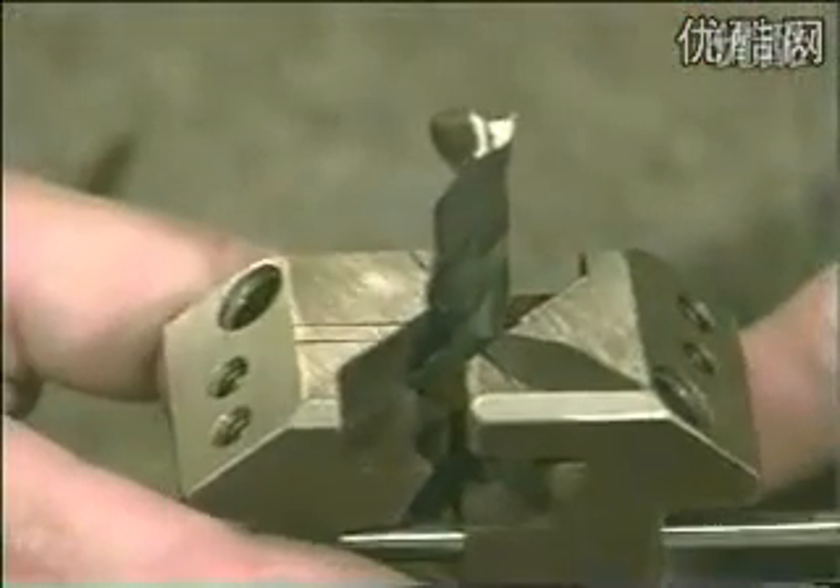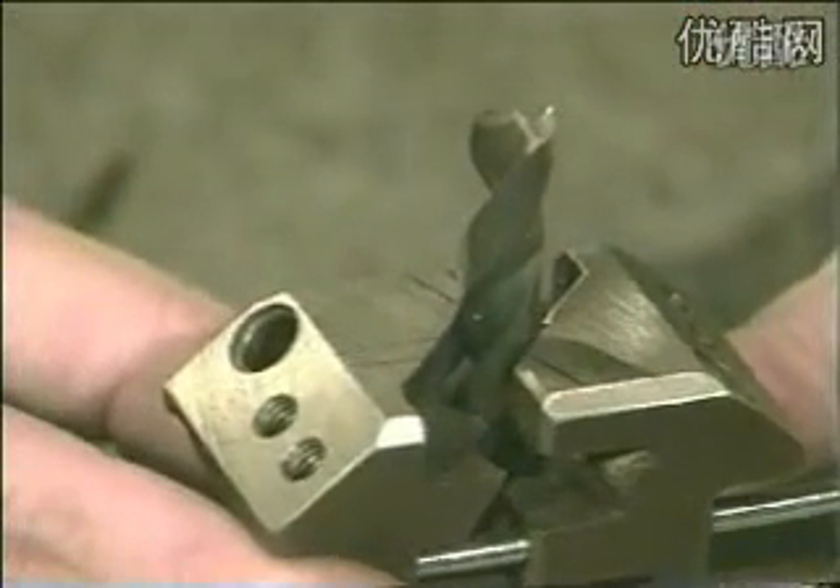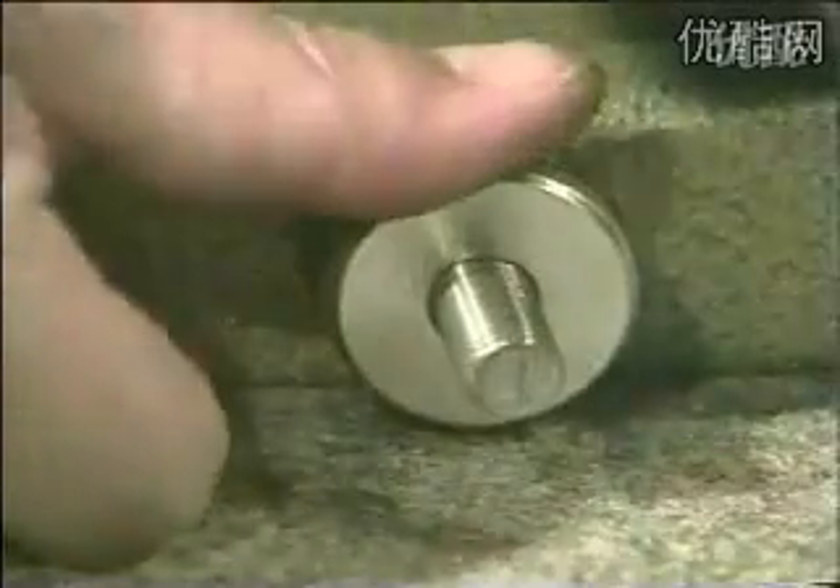Brad point bits are ground with the grinding wheel dressed at 45 degrees on the right side of the wheel. Drill bits with spirals on the periphery, namely wood bits, can be ground by using a profiled 5 mm thick grinding wheel. Start on the left outside spiral and move the grinding wheel with the motor feet inwards to the center.